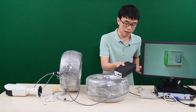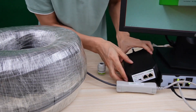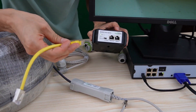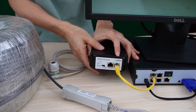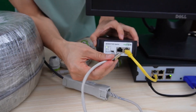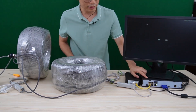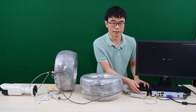First, power up this PoE extender. I need more short patch cords — I'm going to use two. The first patch cord links the PoE injector's data port to port number one on the NVR, so we have data exchange between the PoE injector and the PoE NVR. Now we have the PoE output. In this solution, the PoE injector handles the data exchange with the NVR, and the power is taken care of by the new PoE injector.